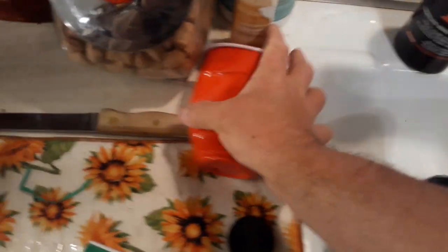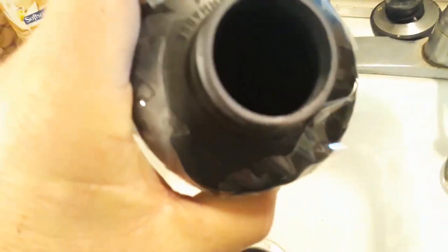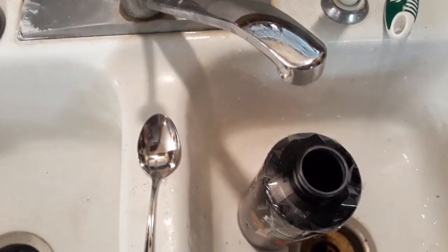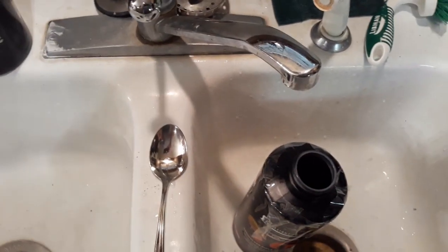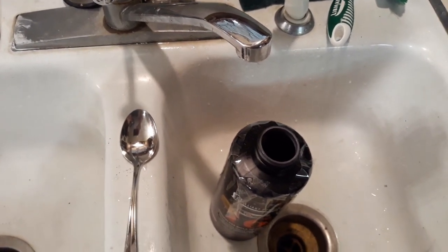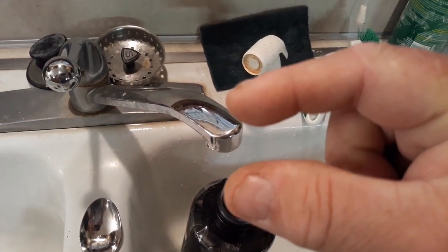If you have a bigger funnel, obviously that will go a lot faster. The bullets are in there and I've put my half teaspoon of molly. I always put a little extra molly just to make sure — I'd rather them be a little slurry and over-coated with some residue at the end than not coating. So for that entire 500 I would use a teaspoon — a small heaping teaspoon of molly. Then I'm going to add the water, just enough to be about that much taller than the height of the bullets.